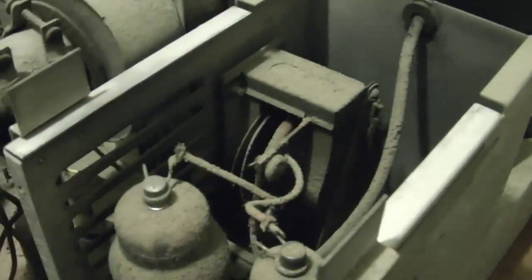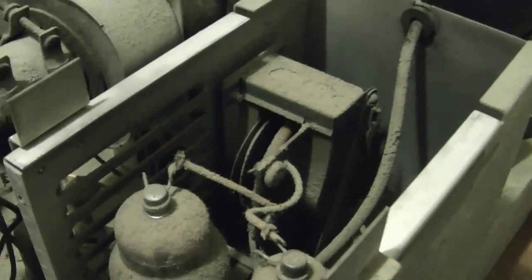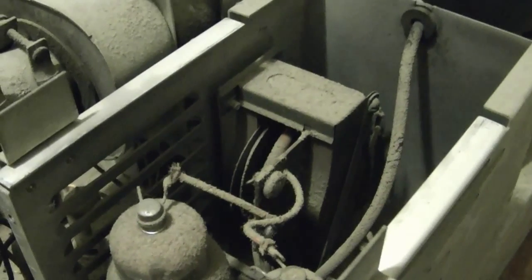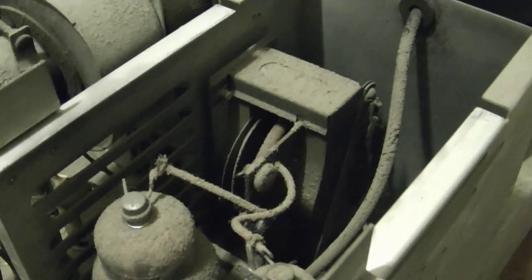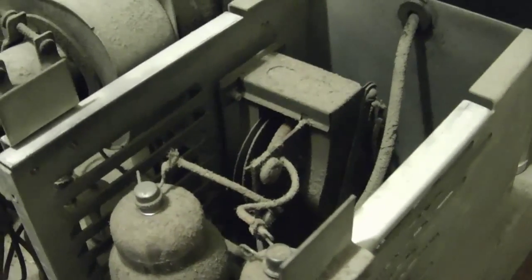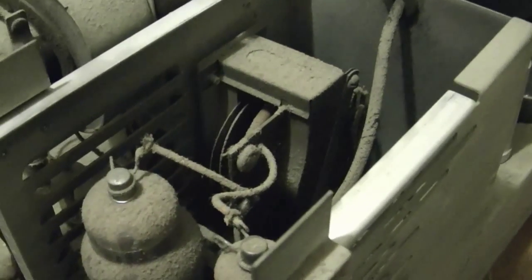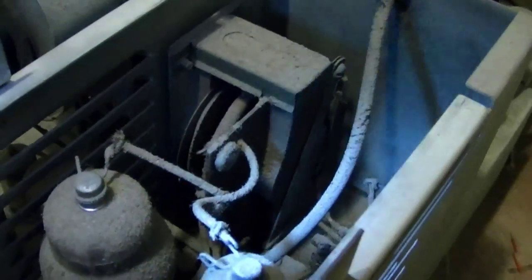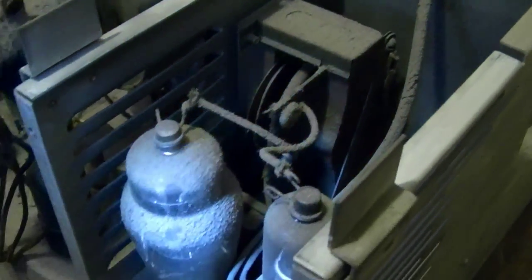This is what I actually do for fun after work, usually late at night. Yeah, looks pretty good in there. And these flybacks are very, well, I wouldn't say they're very common, but many, many sets in the late 40s use them. Actually, going back to the first RCA, the 630TS, it's what Thordarson replacement calls a Fly 1. For sure, all the early Admirals used them. I think all the early RCAs used them, and all the clones. So I've got a few spares on hand.